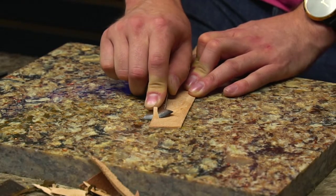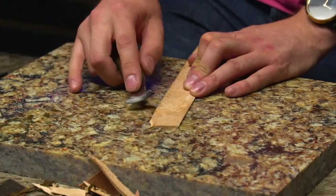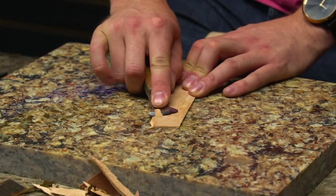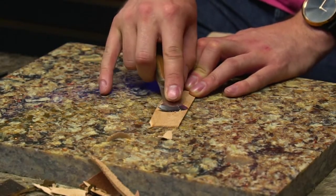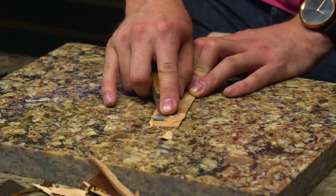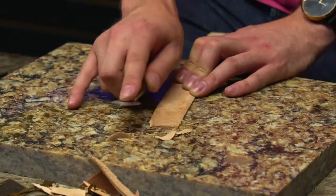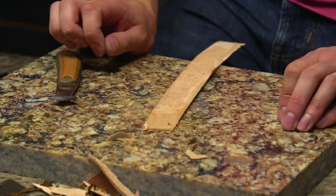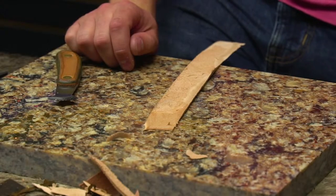If you sharpen your belt punches, your end punches and stuff like that, and you're driving it straight down into a piece of poly, it's going to be sharp one time. Then you just hammer it into the poly, and now it's no longer sharp. You can get a lot of good mileage out of stropping your punches. I strop all my round punches and belt punches and stuff. Strop them for sure.